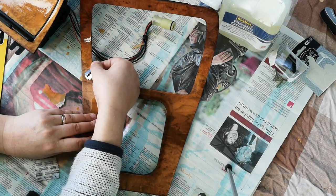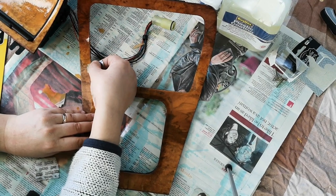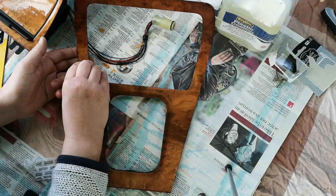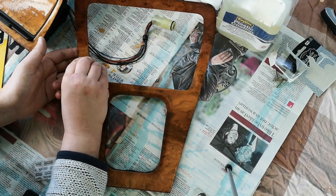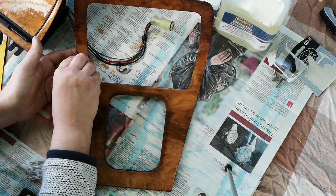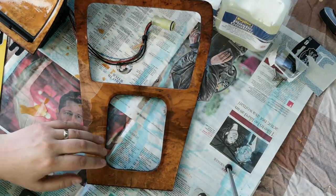That's actually gone a little bit too far — it has snagged a bit of the actual veneer, which I don't want. I just want to get, as far as possible, the varnish. Thankfully these blades aren't as sharp as I thought; they're thin enough to get underneath but not sharp enough to cause too much damage. However, be careful handling them — don't be like me doing it with bare hands. Possibly wear a pair of gloves or similar protective hand equipment.